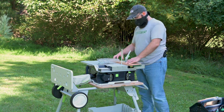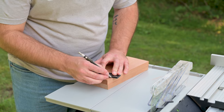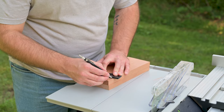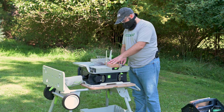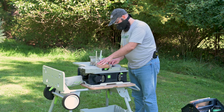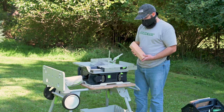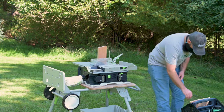After the two sides are cut, they need an angle on the top that takes them from nine and a half inches in the back to eight and a half inches in the front. This is where I really fell in love with the saw — all I did was connect the dots, mark a line, and use that to line up with the mark on the table saw that runs in line with the blade. This was super accurate.